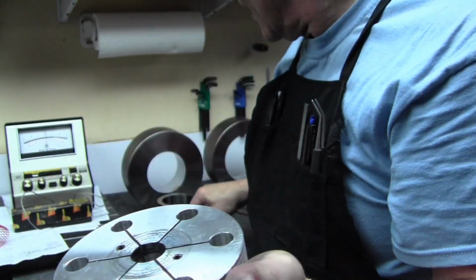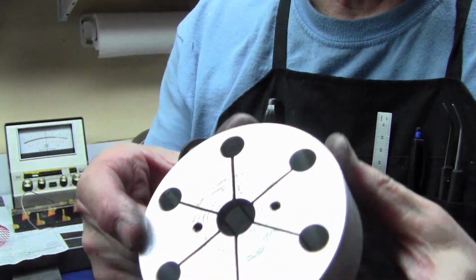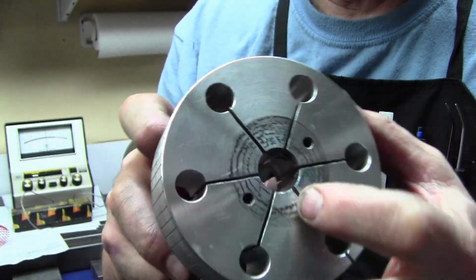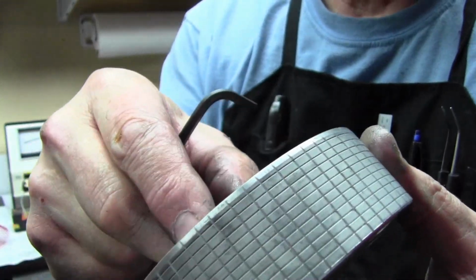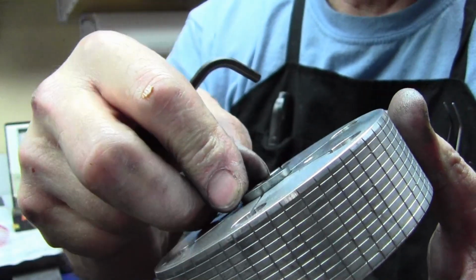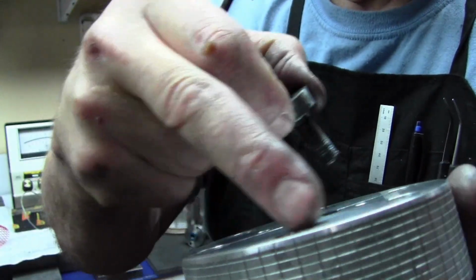So when you make the lap, we turn the solid diameter. We put our pilot hole, 3/4 pilot hole. We just put an actual ledge on here for the expander screw to hit on. I don't turn a matching taper or whatever. I just have a little shoulder down in there that allows it to hit on the shoulder. Once I've done that, I drill my holes.